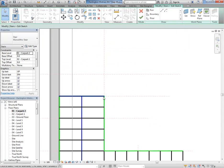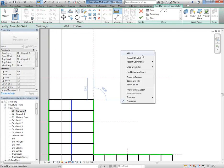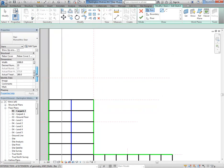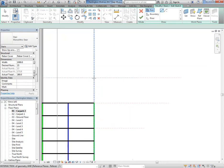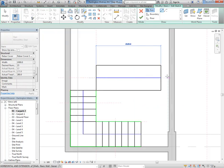To draw in a new flight I need to make sure I've got a reference plane that's 500 from the corner, and I do, so that's okay. I can then just use the Run tool and check the rise count — I'm not going to change that. I'll leave the width on 1000 as well. Now I can draw from the intersection of those reference planes, zoom right in to make sure I get the right one, and take it over to the right as far as it can go.